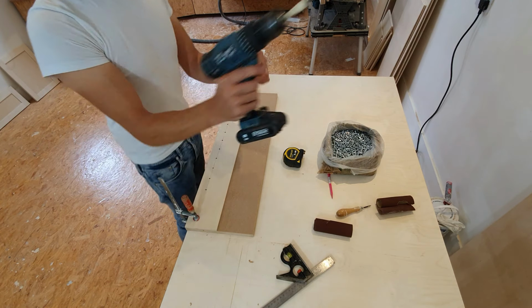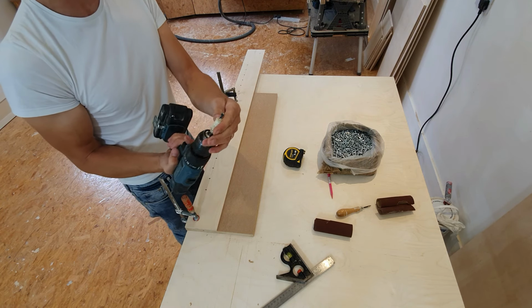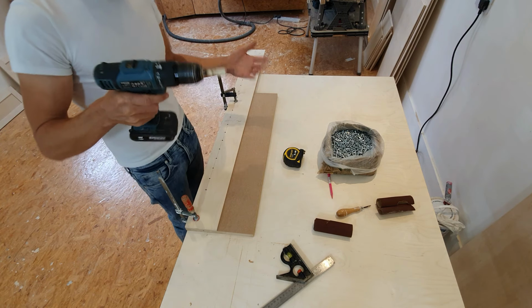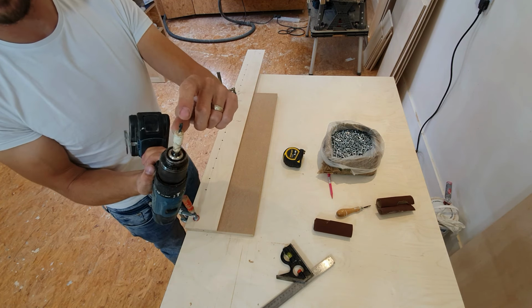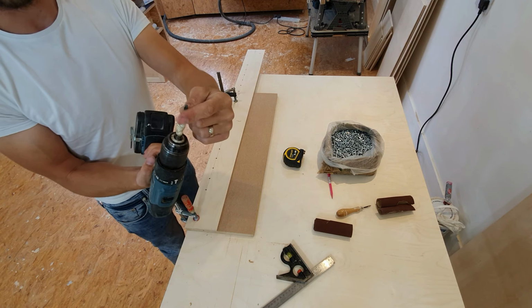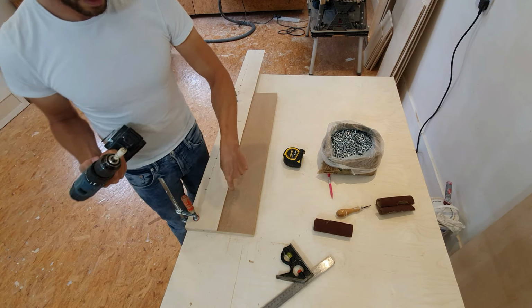Right, like I said, I've set this up to about 16 mil and it's a bit crude. It's just masking tape just been placed over there over time and it's worked. This has worked for about 3 or 4 months. And all you need to do is put that in the hole. And like I said, it's about 16 mil from the start of the tip to the masking tape. And that allows for the thickness of the template plus an 8 to a 10 mil depth hole.